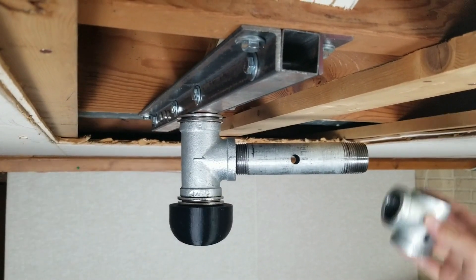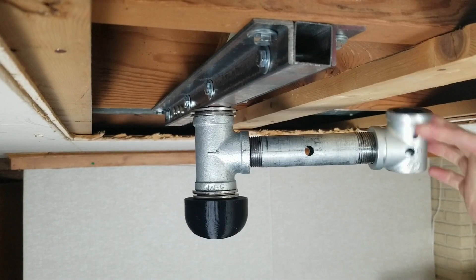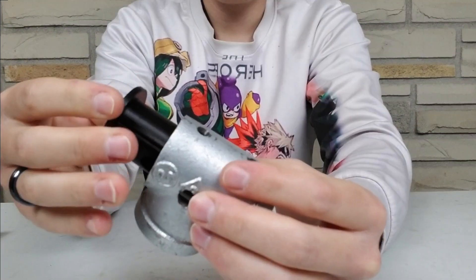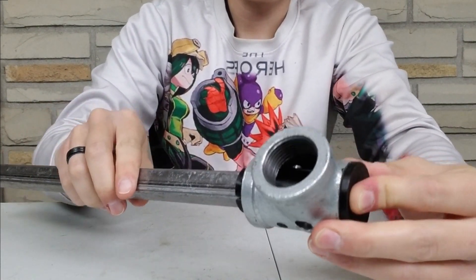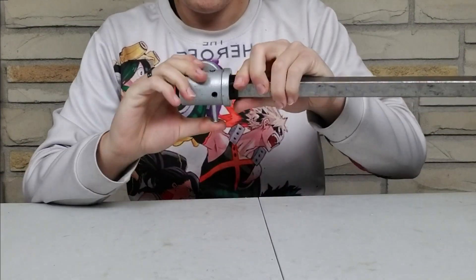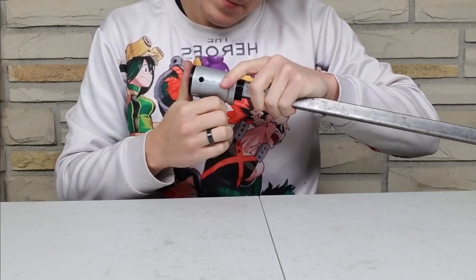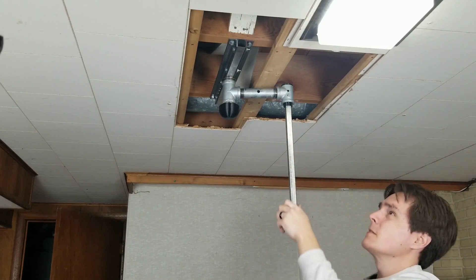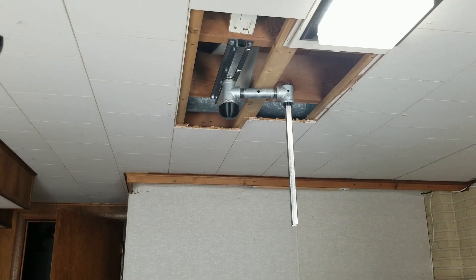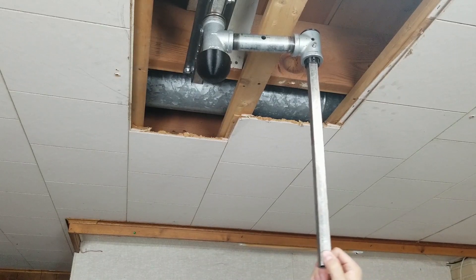I have a pipe coupled to the swivel and started working on the other end of the pipe — I needed a way to couple the rest of the rig to it. My first idea was to use another pipe tee, so I 3D printed a part that goes inside the tee and acts as a spacer. I'd insert a square rod into the tee and the spacer would hold it snug, then put a bolt through to secure both pieces. This idea had problems: it was hard to get the bolt through since I didn't want the holes too big, and if any hole was slightly off it was hard to push the bolt through. In the end I had to use a hammer to drive the bolt through all four holes — and even then, there was still a lot of play, so the square tube could move around quite a bit and wasn't very rigid.